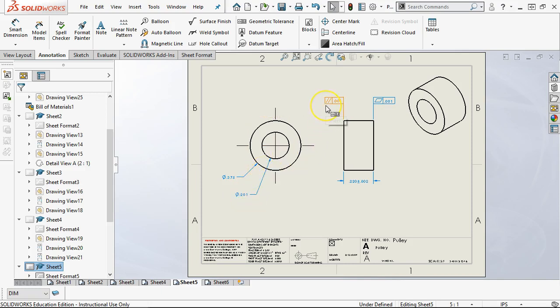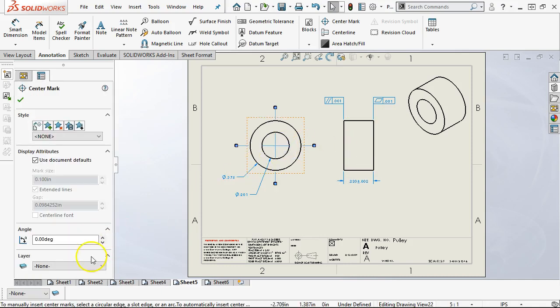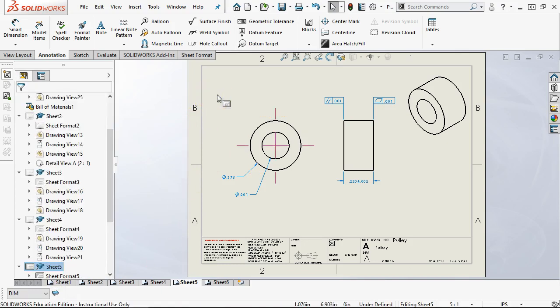But in reality, the only critical dimensions are what we set, having the flatness, having the parallelism, or if we went back to the axis and the virtual condition, and since I'm here, I'll go ahead and set my center line. Having the axis and the virtual condition, I don't want to make it that complicated that it has to be perpendicular. From an inspection side, we'll stay with the flatness, and I'm not too worried about the 201. So just a quick check before we let that one go.